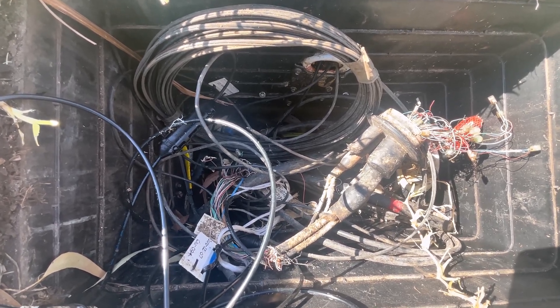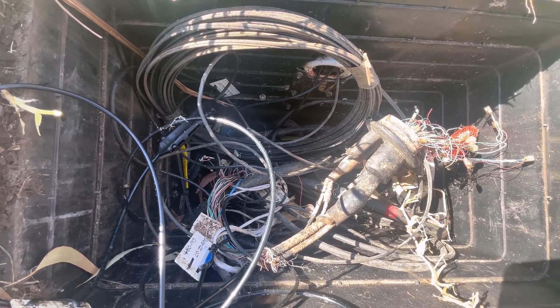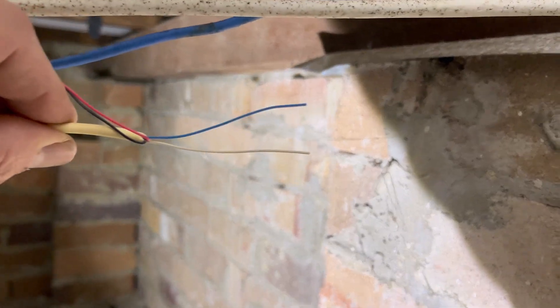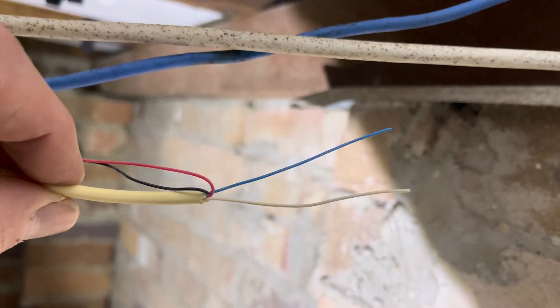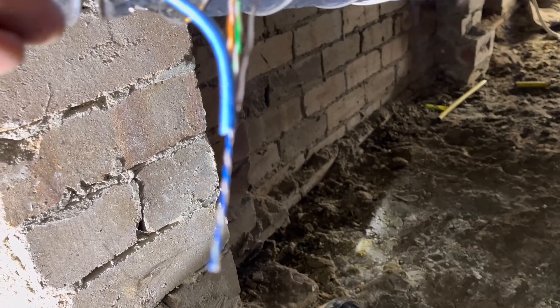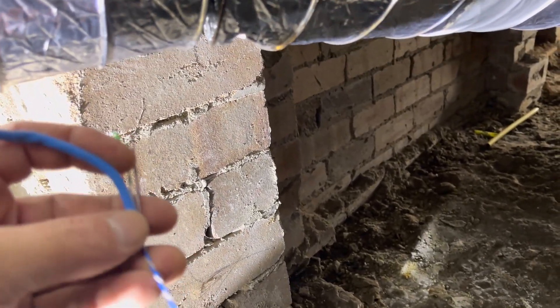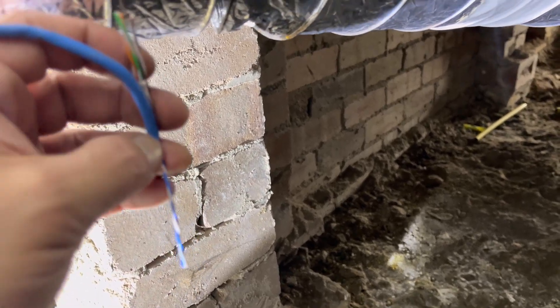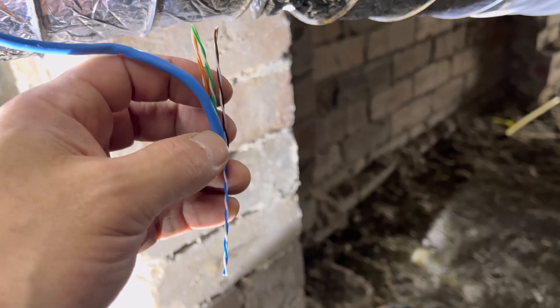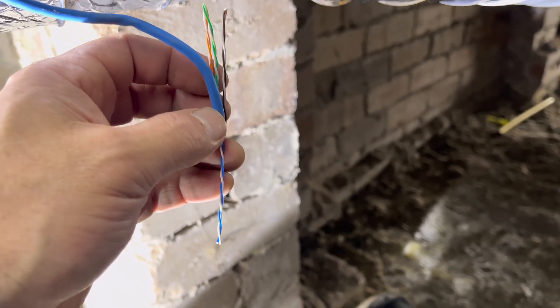I don't think it is the bridge tap that's the issue, but I'm going to remove that anyway. I'd say the issue is directly the leading cable. So when removing the bridge tap, I'll always cut the cable back, re-cut it, and then strip it back. We've got the blue-white pair there now — this is the other one that's not been used. This one is running out to that leading cable you've seen, and this one should be the one going to the socket. When I put my tone on up there, I was getting only a tone on one pair from the F-set, which generally means there's an open circuit or high resistance on one of the legs. So I'm going to join this up properly with Scotch Locks, and then we'll go and fix the leading cable.